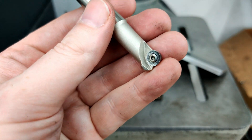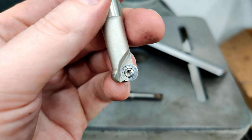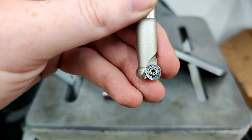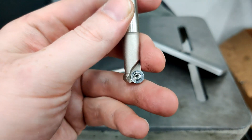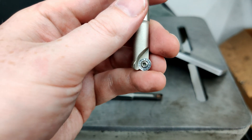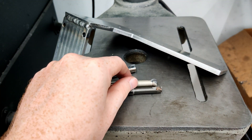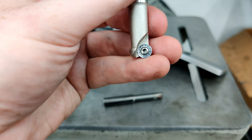The EMRC 12 — I've been using it as a high feed cutter, and it works pretty well. It has a giant radius, I think four millimeters, which makes it really hard to damage. I've been running it at about 0.1 millimeter depth, which means it's doing mostly axial cutting rather than radial cutting — great for my machine which is set up to handle those kinds of stresses.